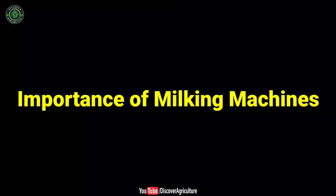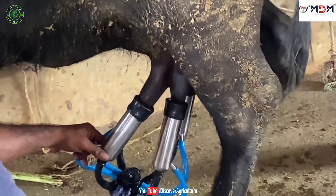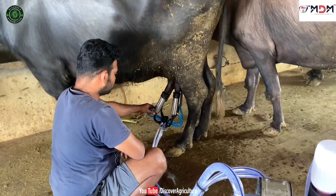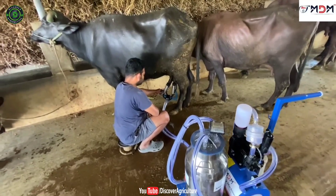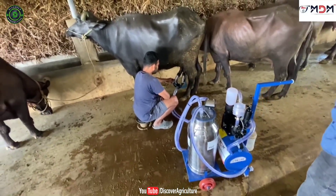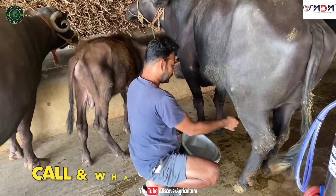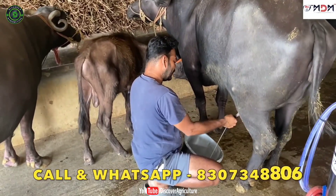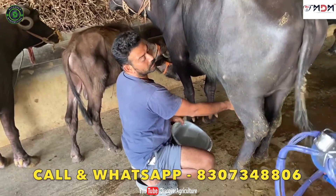Importance of milking machines. The milking machines of the modern day are excellent for milking cows and buffaloes. They do not cause any harm to the udder. This equipment mimics the sucking of the calf. At first it uses a vacuum to create pressure, allowing milk to come out into a container. Next it will massage the teat, which avoids the blockage of blood. This machine is more comfortable for cattle than the manual hand milking process.